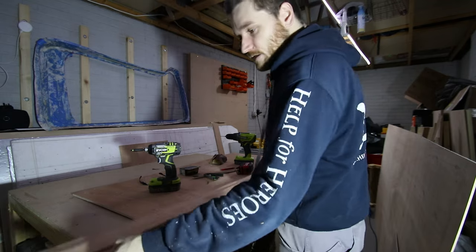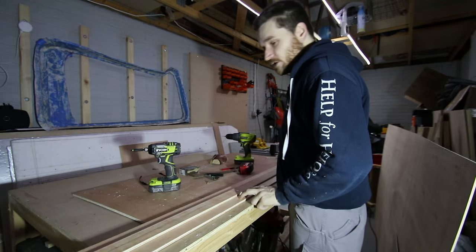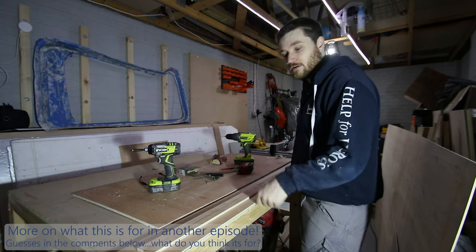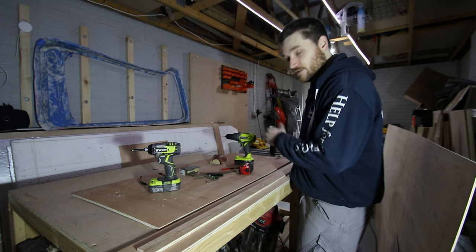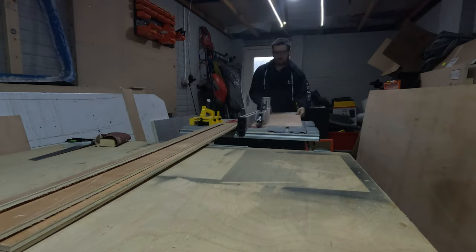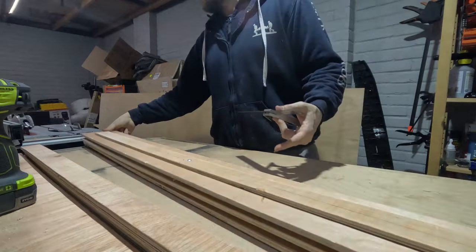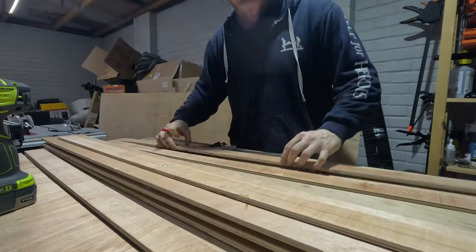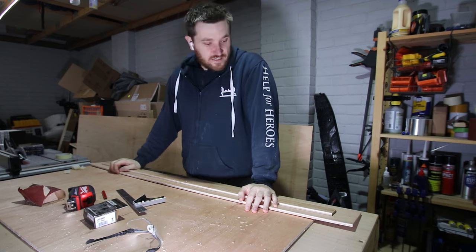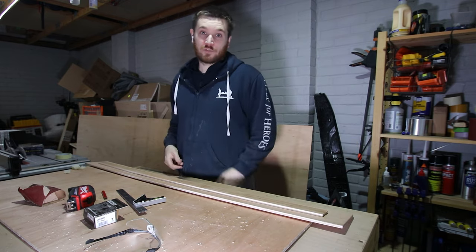What I've done is cut out a 9mm bit of ply to 135cm, which is the distance I want to cover, leaving a tiny little gap on both sides of the rib. I've got that single template and I can rinse and repeat with the rest. All that's left is to take it into the van, offer it up to the ceiling, and get it all fitted.